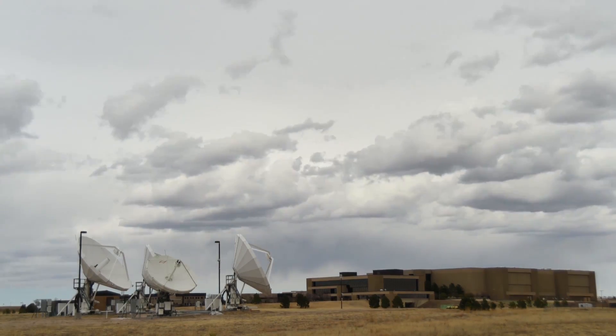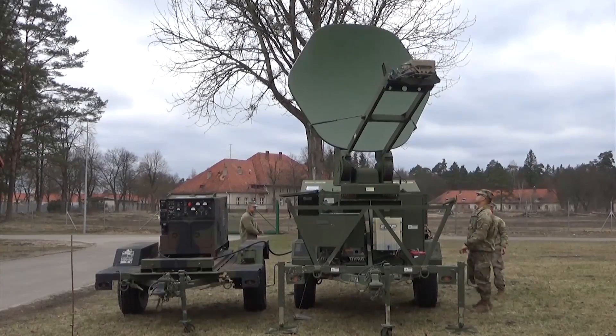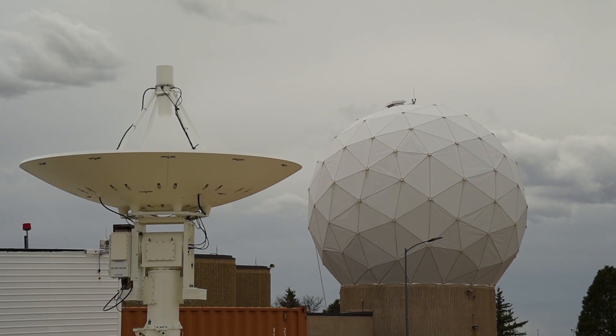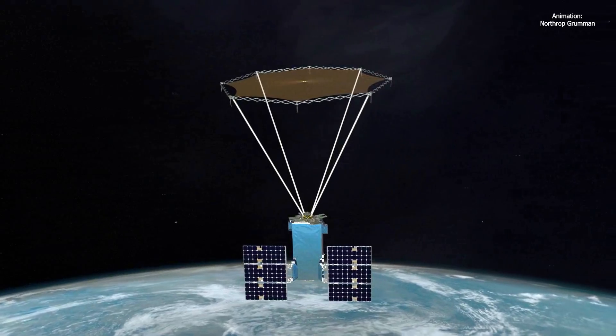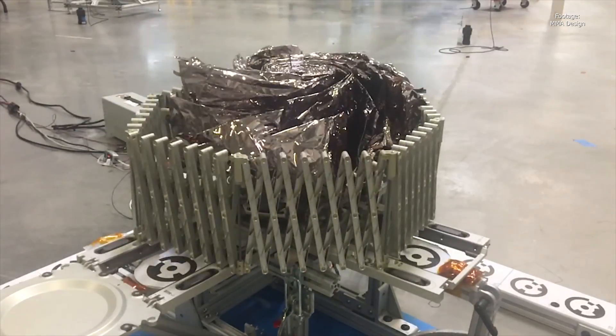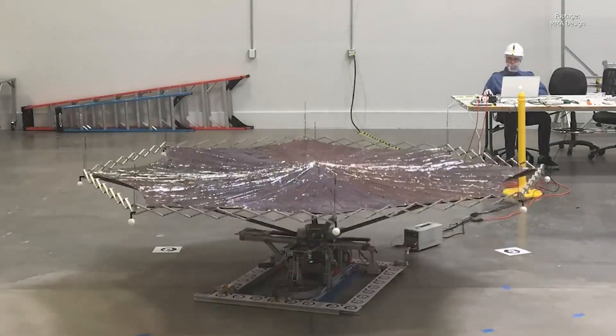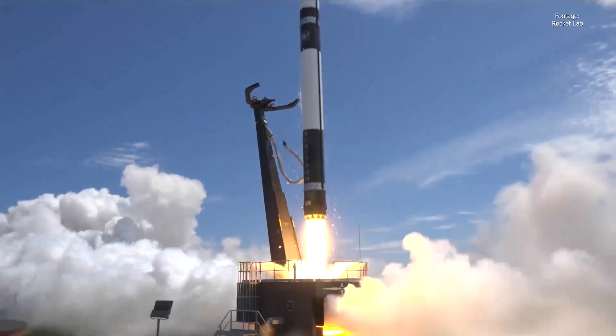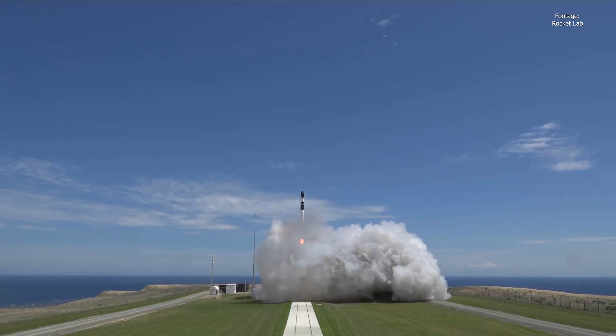An antenna has a lot of different uses for DoD. One example is communication. The antenna and the power you have in the satellite dictates what size of antenna you need on the ground to receive it. So the bigger the antenna you can have in space, the smaller the one can be on the ground. Fitting that very big antenna into a smaller satellite makes the satellite less expensive and allows us to leverage different types of launch vehicles that maybe we wouldn't be able to use for bigger satellites.